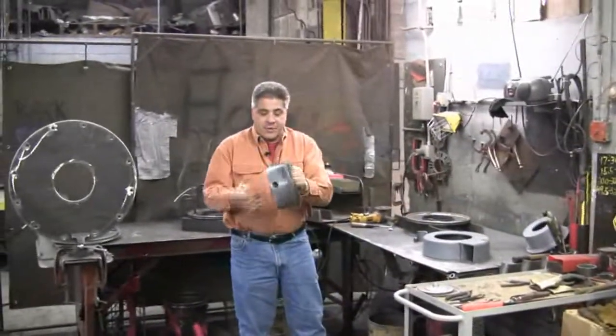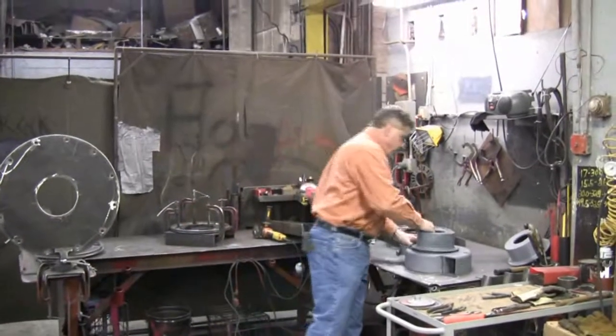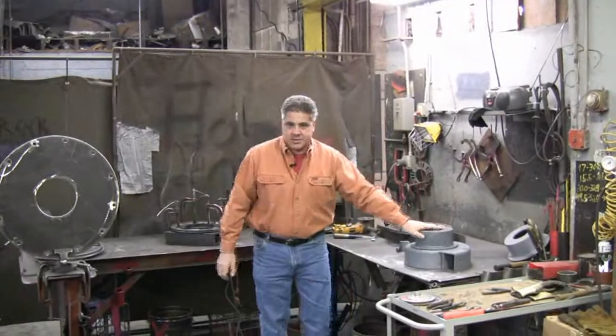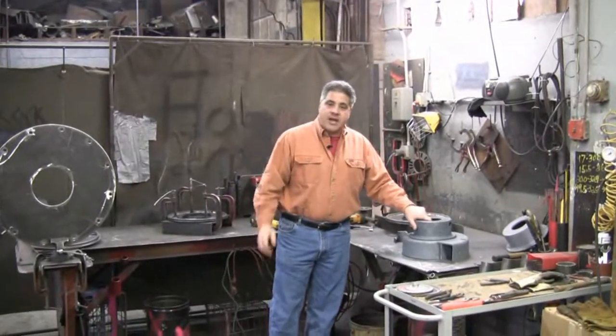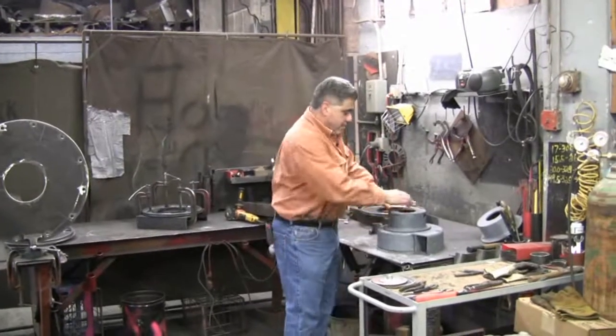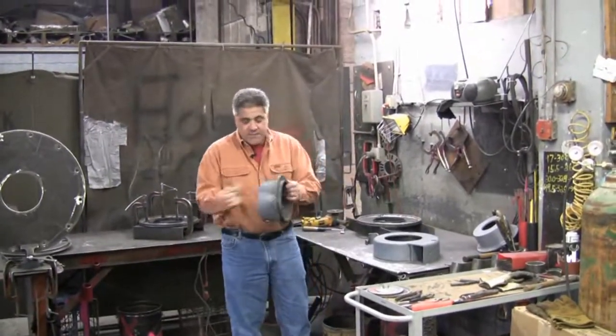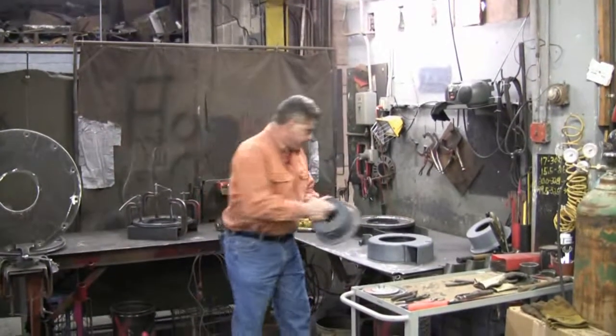Combustion head for an Infern-o-Therm burner. This is filled with high temperature refractory. This bolts onto the air turret, and this is where ignition takes place. You've got the electrodes, the oil nozzle, and/or the gas supply for the pilot come through and are bolted onto a nozzle assembly plate on this. And again, as you can see, virtually indestructible.